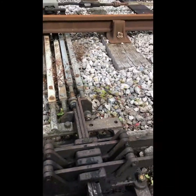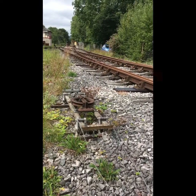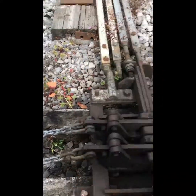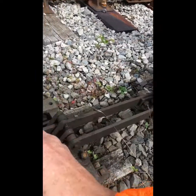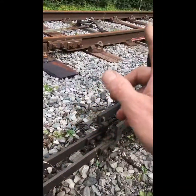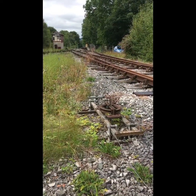As you can see, this one's lined up — there's a slot in there — and this one is anchored. So when we pull the signal wire from the signal box and it pulls the framework that way, the anchored wire cannot move but the free wire can. This is where there's an interesting design consideration you've got to account for: you must have a certain amount of slack. Unlike a normal signal where it starts to work straight away, the floating wheel system has a lot of loss to start with as it anchors the first wire and then takes up the slack in the second wire. If you have it too tight, it just won't work — you'll end up jamming the detectors, and it won't go back on the stops. You've got to have a little bit of slack, and you'll find it's almost the last three-quarters of the pull before it comes off. This works better on ground signals because they have a lot less movement.